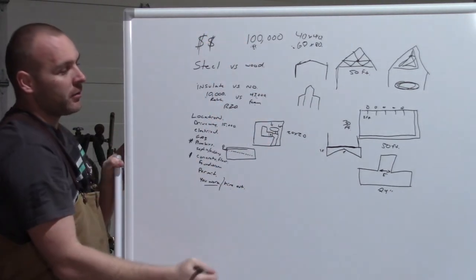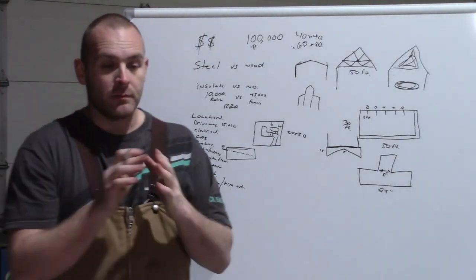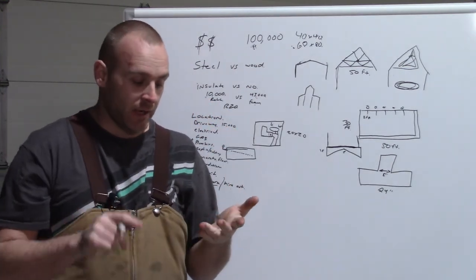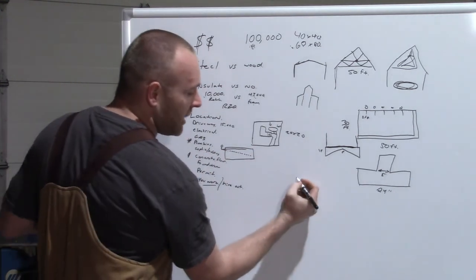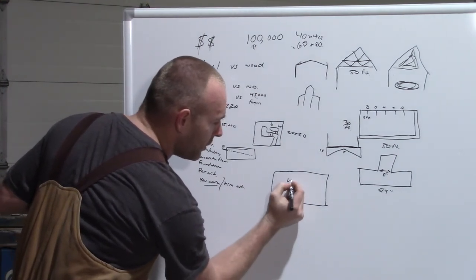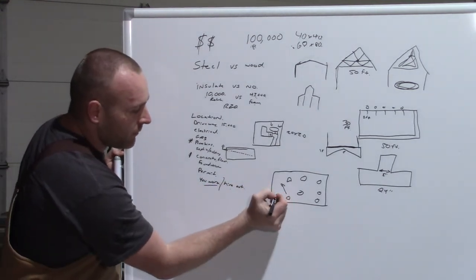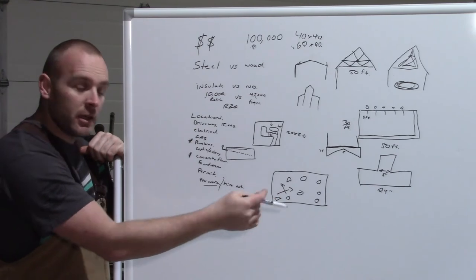All of these things are going to factor in. And I can tell you one thing that I did was I just took a normal sheet of printer paper, and let's say that's 8 by 11. I scaled down another piece of paper and I cut it out the size of a car. And I did my welder, and my trailer, and my welding table, and the hoist. I had all of these things cut out, and I was able to take that printer sheet of paper like this and move all these little boxes around wherever I seemed fit. Let's say it's like that. So I can move them all around. I took a picture with my phone, and then I scrambled them all about again until I got the design that I wanted. Then you can accurately see, do I have a ton of area here or do I not?